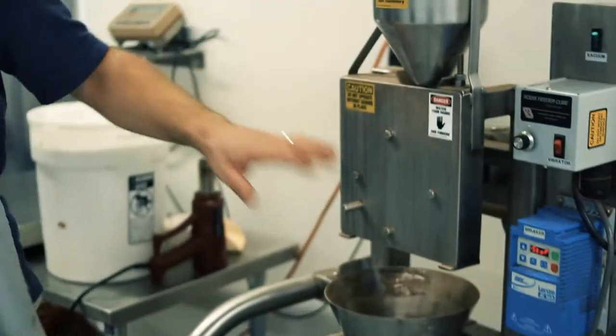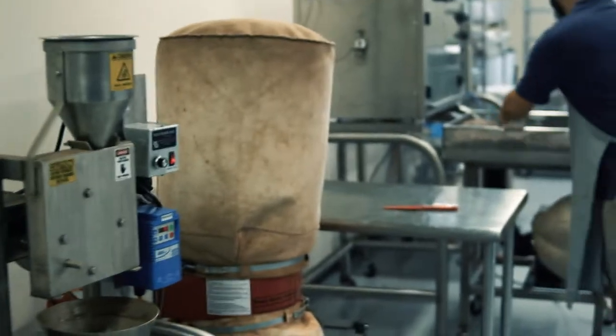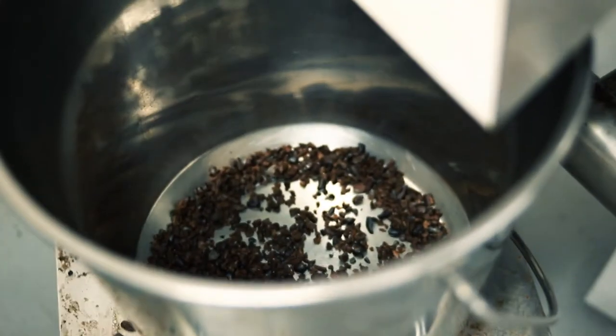The middle part is the nib and that's what you're actually going to grind into your chocolate. The cocoa nib is about 50% cocoa butter, so when you grind it, it's going to tear the cells and release the fat — it's like making peanut butter at home, it turns liquid. There's a wheel in here that's going to crush the beans against the screen and they'll rain down over this vibratory conveyor. This dust collector is then going to pick the shells up as they pass under these vacuum pickups. Once it goes under the vacuum, you're left with mainly just the nib, and we'll sort out any remaining shell pieces by hand before the grind.